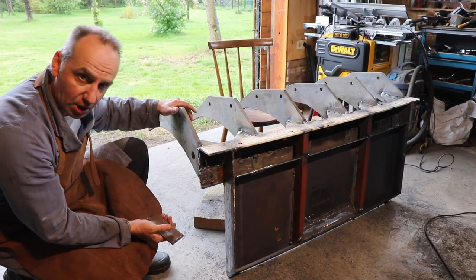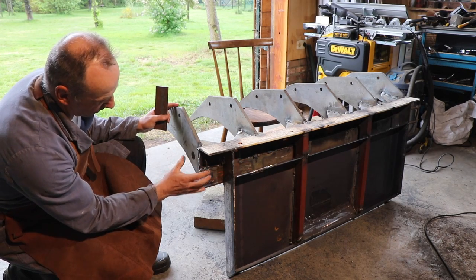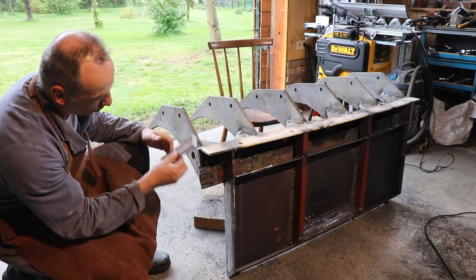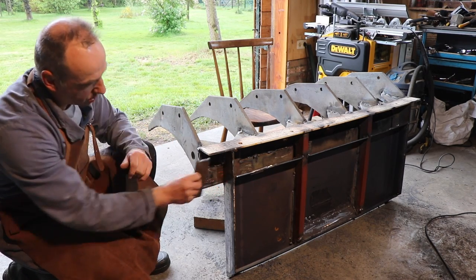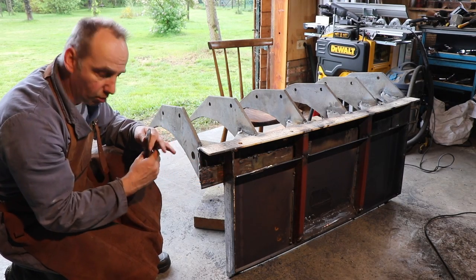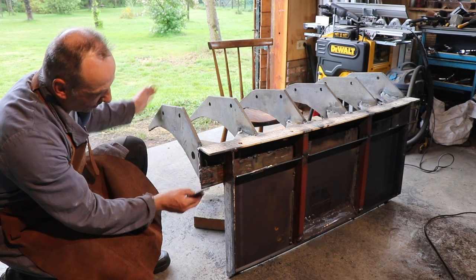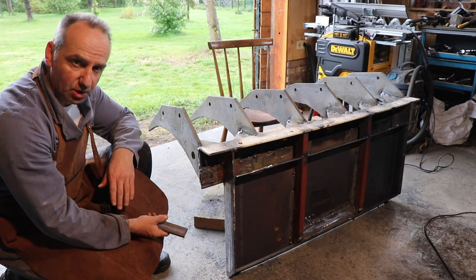This is the outer rake, and when there's going to be a load on it, there will be a torque on the construction. Now this is an open construction at the end, and an open construction is not very stiff for torsion. So what I will do is add a piece like this and also one on the edge. Then I will make it a closed construction. And a closed construction is much stiffer for torsion than an open construction, because an open one can just bend open. But when it's closed, that's not possible anymore, and that's why it's much stiffer for torsion.